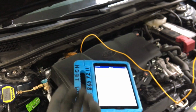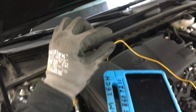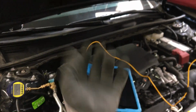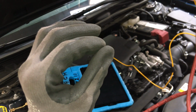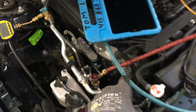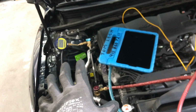So now I'm fighting vaporizing off moisture. If these were glass and you could see inside the compressor where there's a little layer of oil and the layer of oil in the bottom of the evaporator, you would literally see it bubbling up and boiling. It looked just like frying oil for your chicken. You know when you have a little bit of moisture and you throw a piece of greens inside frying oil and the water boils off? This is what is happening inside this system and you can't see it, but a micron meter can read it and you literally can tell.